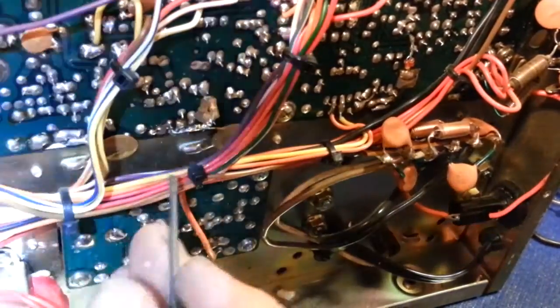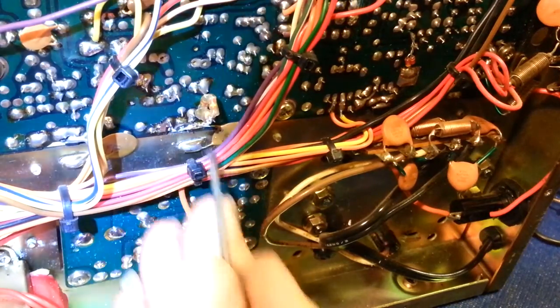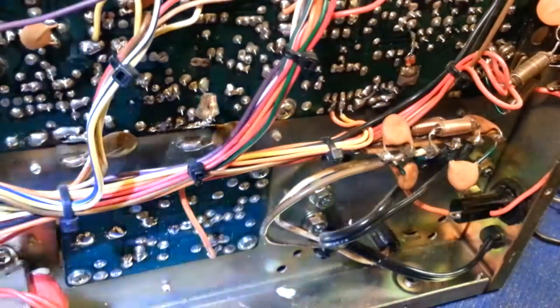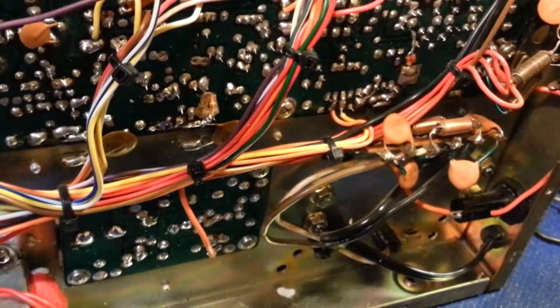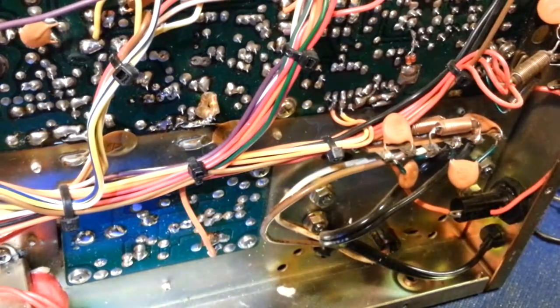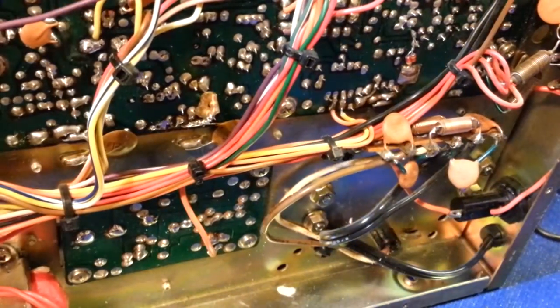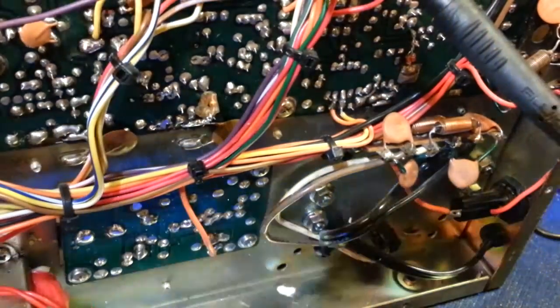I'm not sure how well you can see it or not, but that's the base right there. It's hanging on by a hair. It just fell off. It broke off, which is fine because the transistor, like I say, I'm going to turn the power supply, my AC power supply isolation transformer, back on. Turn the radio on. Now, we're going to hook up a voltmeter. So there should be absolutely nothing on the base right now because the base is not connected to anything.